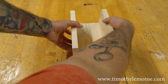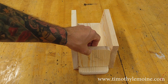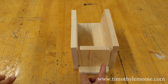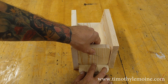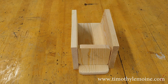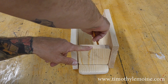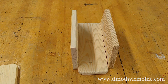The placement of your bottom is very important to the longevity of your bird house. If I stick it all the way down to the bottom so that it's flush on the end, water is going to pool up there and it's going to rot out. You won't have a ten-year-old bird house — you're going to have one that lasts a few years and then it's done. I like to build things that are going to last longer. So what I do is I just push this up about one-fourth of an inch, double-checking that nothing slid around. After I've slid that up one-fourth of an inch, I want to transfer this — I'm just tracing on both sides where this piece ends up lining up. That'll allow me to get holes drilled in the correct spot.